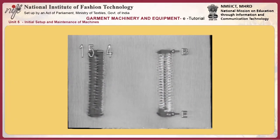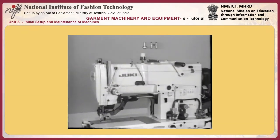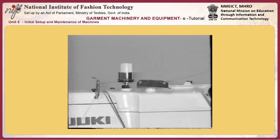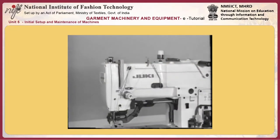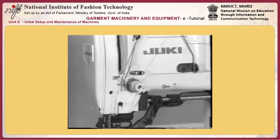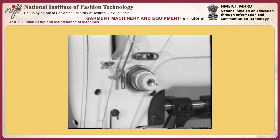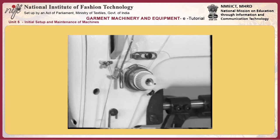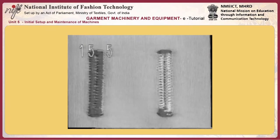Whip stitches are zigzag stitches in which only the needle thread appears on the right side and the bobbin thread only appears on the wrong side of the material, since the needle thread and bobbin thread interlace with each other almost at the center of the material thickness for bar-taking sections B and E and parallel sections C and D. This type of seam is soft in appearance and is usually used for sewing knits and knitted fabrics. Stitch type can easily be changed over between the purl stitching and whip stitching only by adjusting the thread tension.